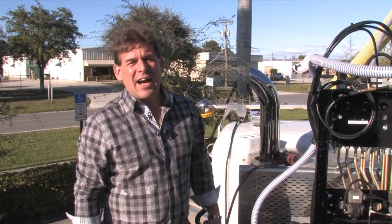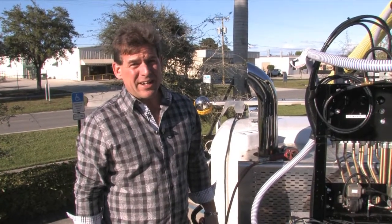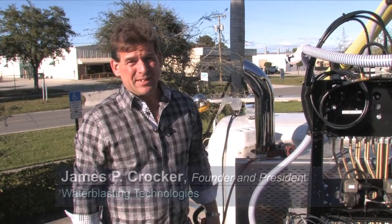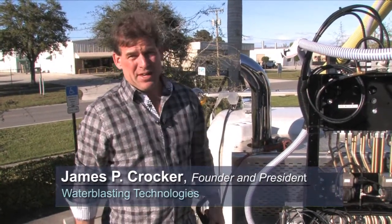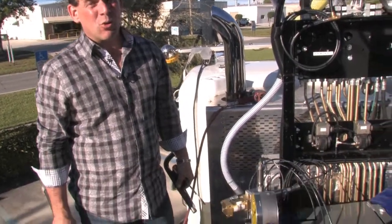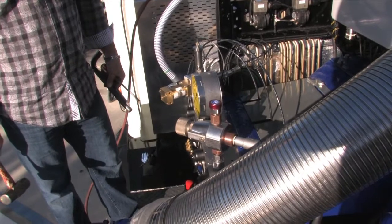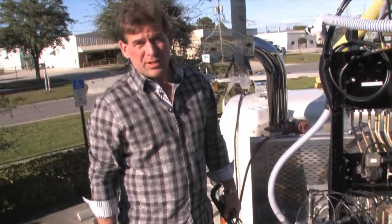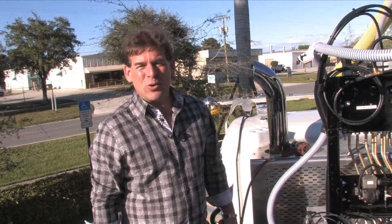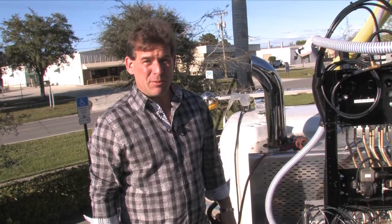As a contractor, I know just how important it is when a machine goes down in the middle of the night to get it back up and running as quickly as possible. This ultra-high pressure pump is the only such pump in the world that does not require a torque wrench to work on it. I'm going to demonstrate for you right now just how quick and easy it is to perform maintenance on this high-pressure pump.